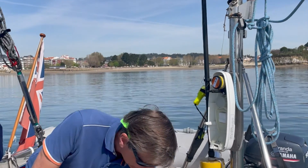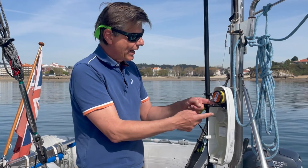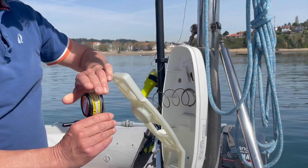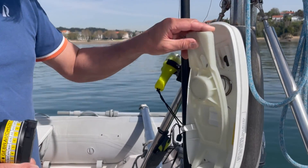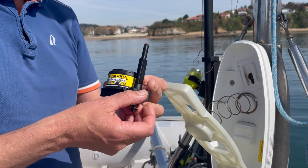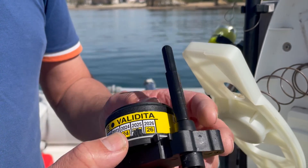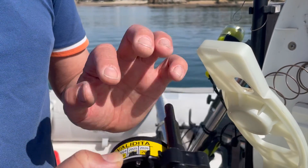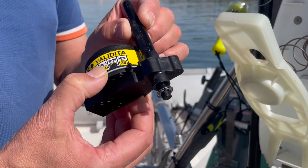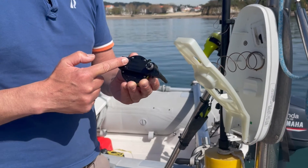You look at the in-date stamp. The idea with the H20 is that it has a knife inside that cuts this bolt and then a spring pops up. You can see it's valid through 2025 because I've just changed it. This one has a bolt, and you must buy this original from Jotron because they are the only ones who supply this plastic bolt. Don't ever use another type of bolt - it needs to be weak enough to be cut through by means of the spring.